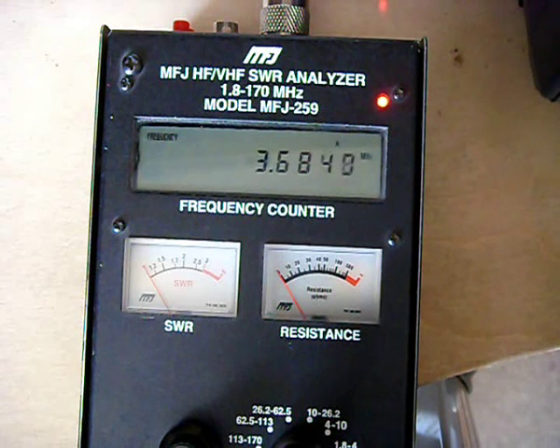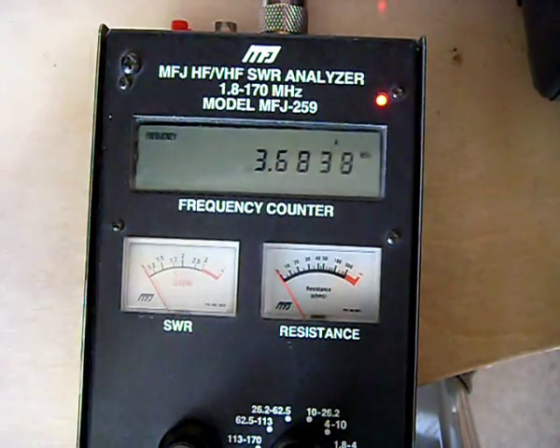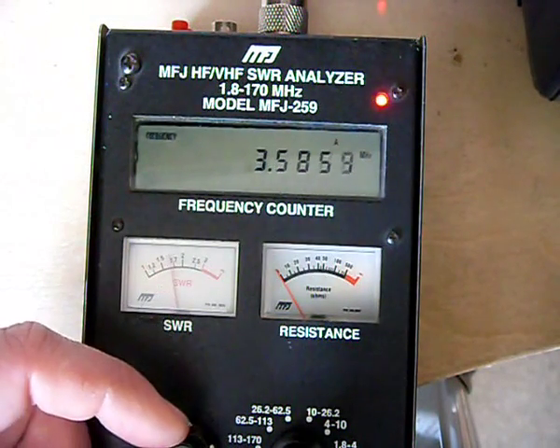I think the last time I scored 31 or maybe 32. It's definitely made it a lot easier having a resonant antenna without any losses. I sometimes use an end-fed wire that's about 85 metres long up in the tree, and that does alright — I can use that on HF without an ATU — but no way does it have the performance of this dipole.